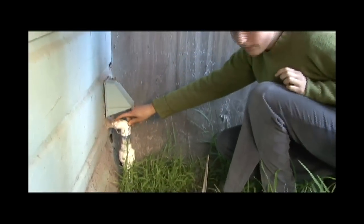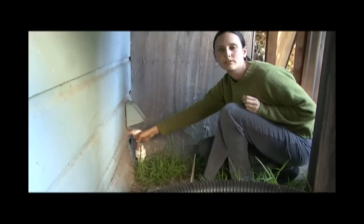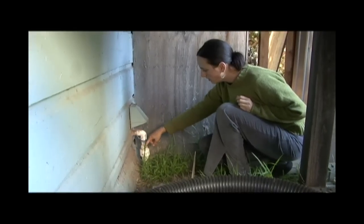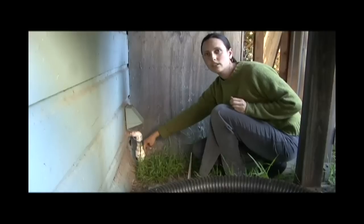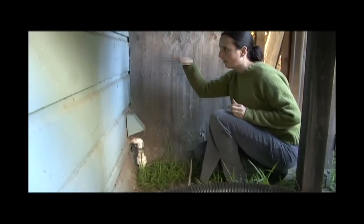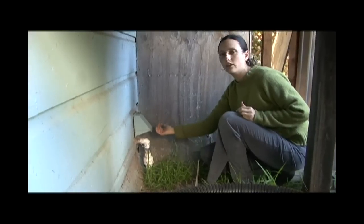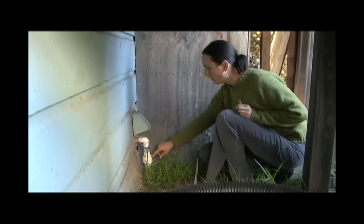The pipe goes out and hugs the bottom of the wall, then through a small hole in the house straight outside. Where the one-inch pipe comes out of the house it's sealed so no air or bugs can get in. It comes down to a check valve, which only allows flow in one direction. If the gray water line were ever raised above the height of the washer, you wouldn't want gray water to back-flow into the house or the washing machine, so this prevents that.